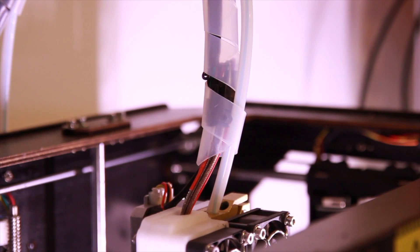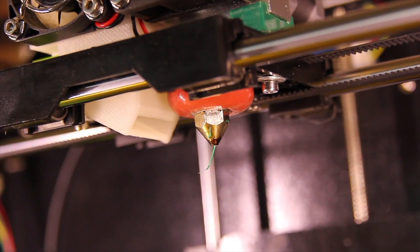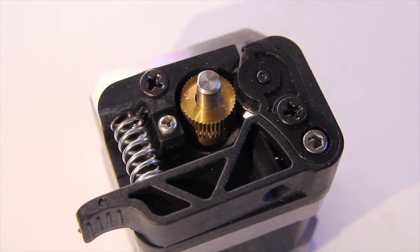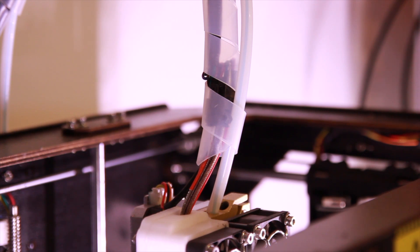One of the biggest problems I kept having was a notorious clicking sound during print times. When you hear clicking it means the filament is not being fed properly and is getting stuck. There's a notched spur gear that grips the filament down a tube into the nozzle, and when it gets stuck or the nozzle gets blocked, it starts clicking — and that's a very bad thing. Mine continuously kept doing this. I tried heating up the nozzle, running at high temperatures, took the nozzle out, cleared it, replaced it, opened up the extruder, looked for debris, cleared the spur gear — everything kept reoccurring.